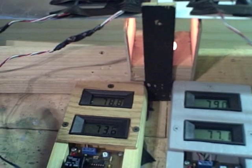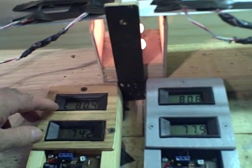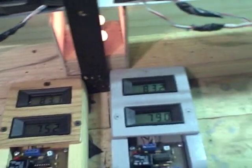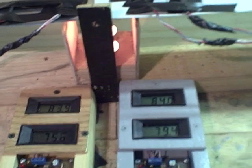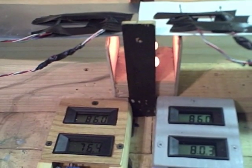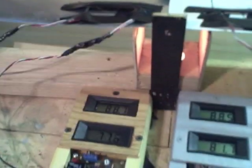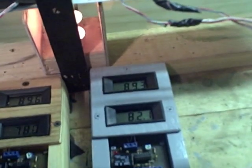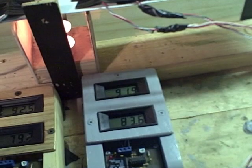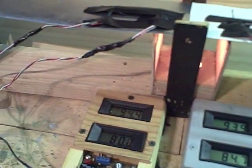The temperature on the left is starting to rise, and so is the one on the right. These are the temperatures only two inches away — it's already up to 80, 81, 82, 83 degrees. The temperatures for both the thick and thin sheets of aluminum are just about the same: 87 degrees and 87 degrees. The temperature at four inches is actually a little higher for the thicker sheet — 84 degrees as opposed to 79 degrees.